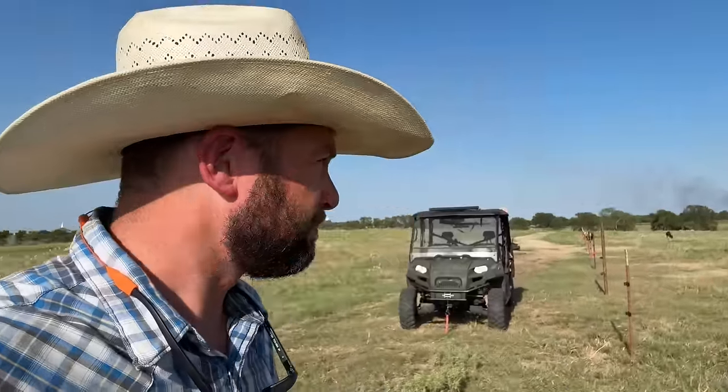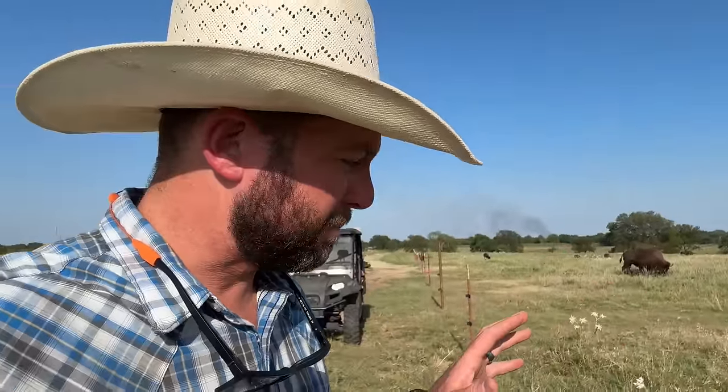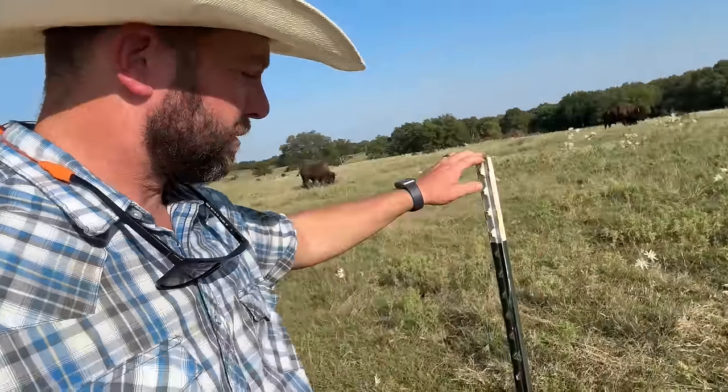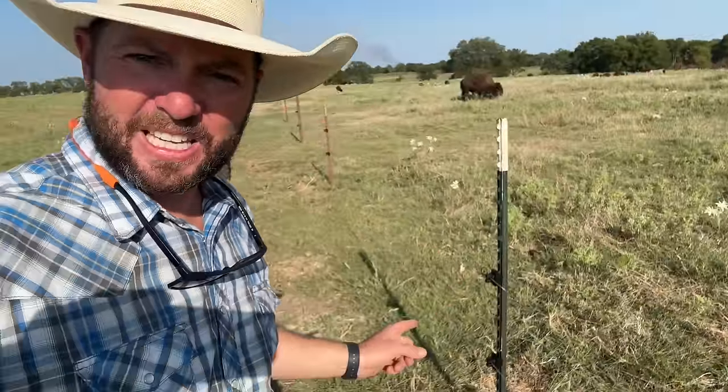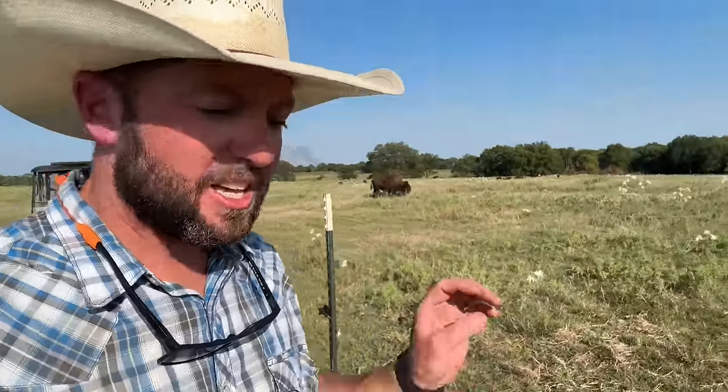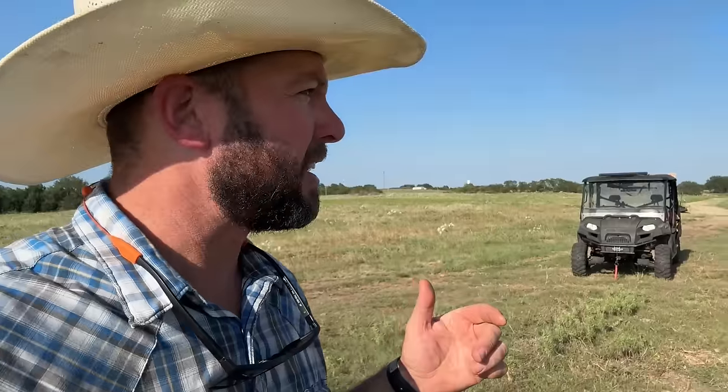All right, y'all. I think I found the issue. So, like I said, forgive me, it's my first time. I walked over here, and I was actually talking to Kevin because where he works, they deal with a lot of hot wire, and so I called him for some experience. I'm walking around talking to him, and this T-post right here didn't have insulators on it. I don't know why, out of all of these, right here in the very center, this T-post doesn't have any insulators on it. So it was grounding out. And I was talking to Kevin. Oh, Big Joe's with a new lady now, right over here.